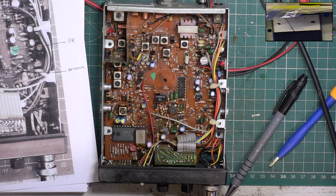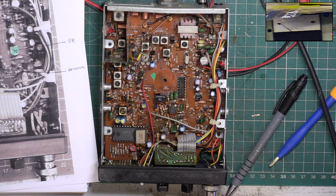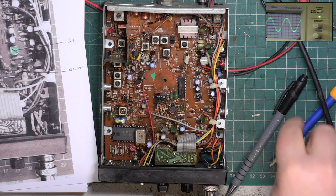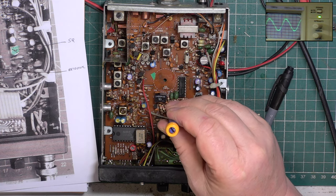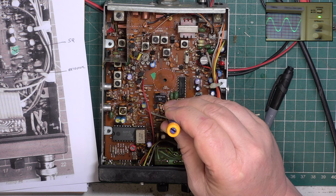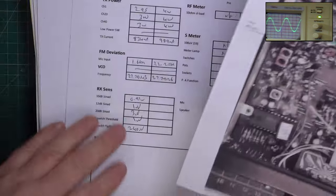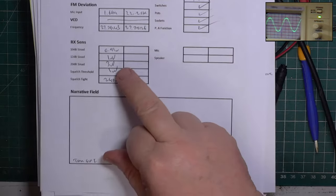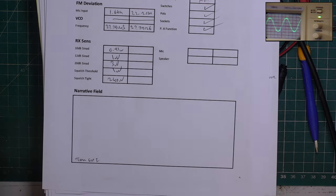Right, so we've really gone backwards and forwards on that. I'm going to recheck the detector. And we'll see if we've got any improvement. Well, very little difference there, so theoretically you'd think it's going to be pretty well the same. So my estimate is going to be, instead of 1 microvolt, probably something like 0.9. That living hope.